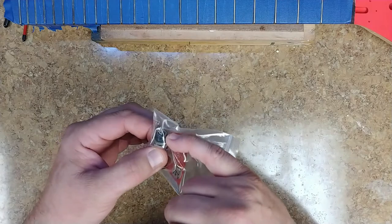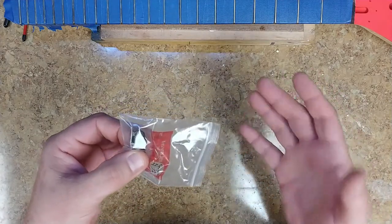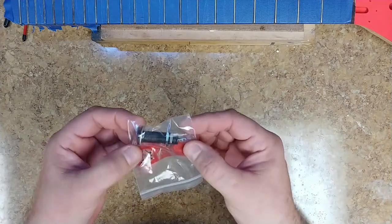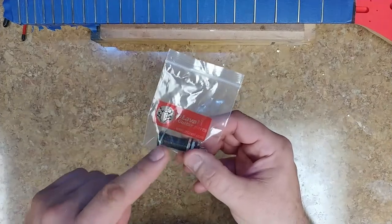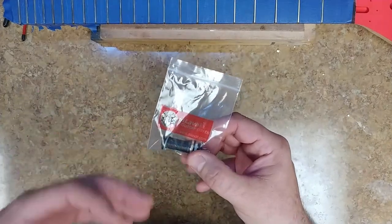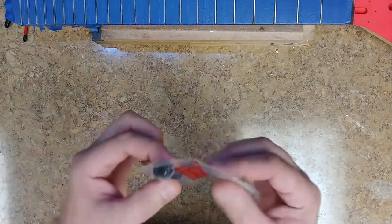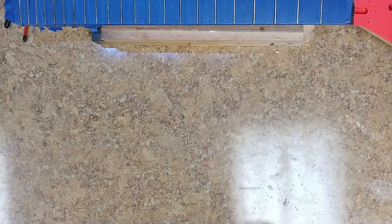This one is switched, so when you plug it in, it should activate the humbucker pickup, which is an EMG USA 81. And anytime you have active pickups or an active equalizer inside of your guitars, make sure you unplug them because it will drain the battery if you're not using it. So that's one thing.